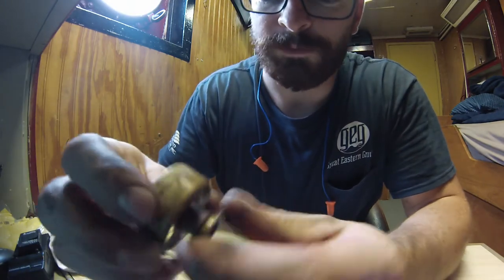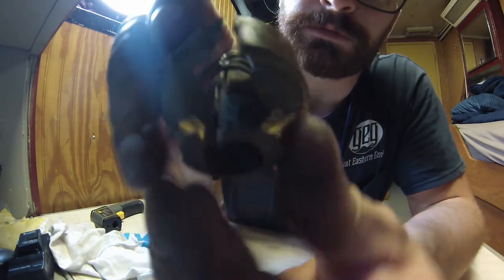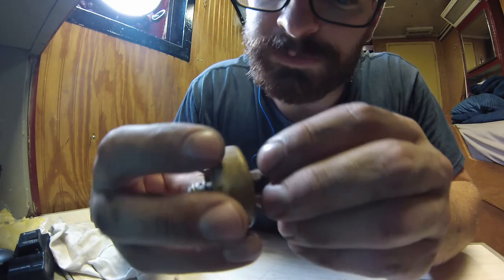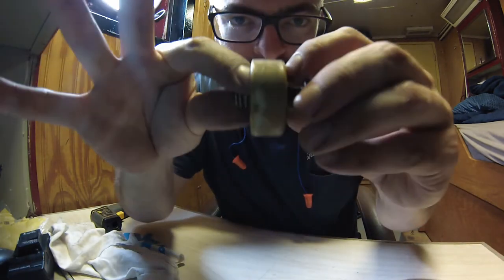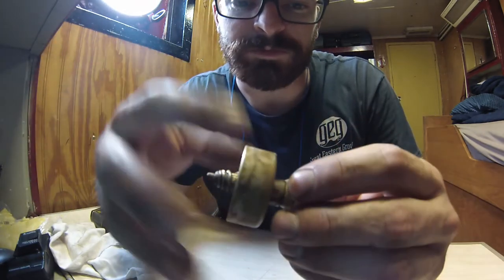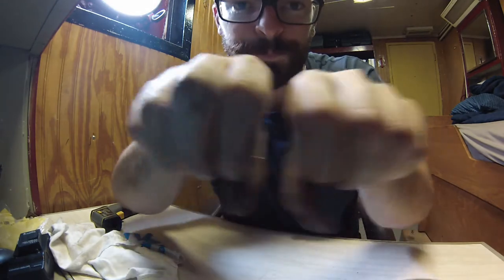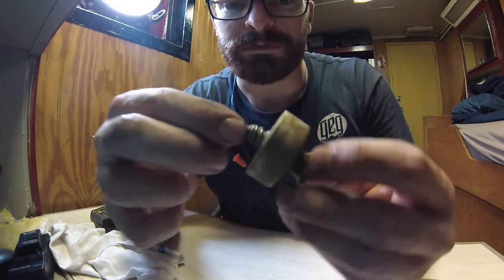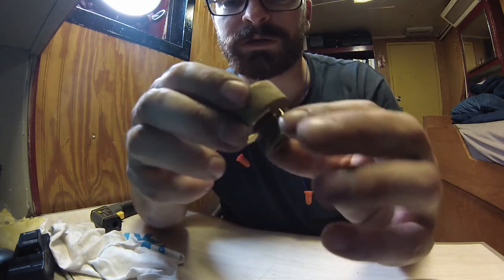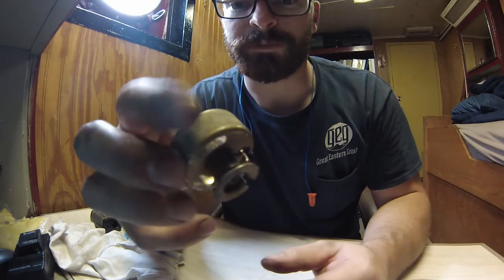Pull this piece out — you can see kind of in there the little piston. There's not a lot in there that does it. A little tiny bit pushes this out. Because the fluid's incompressible but it expands when it gets hot — that's the idea. This turns into a liquid and pushes this piston against the spring and moves this piece. That's how these work.